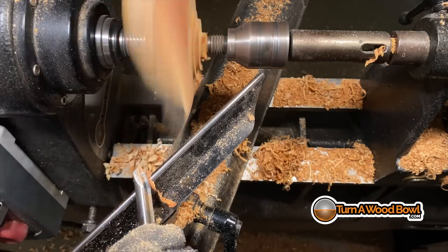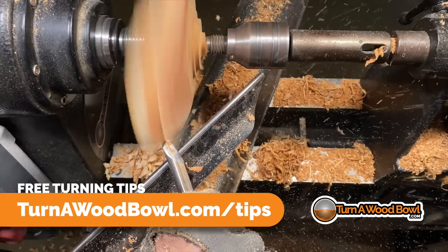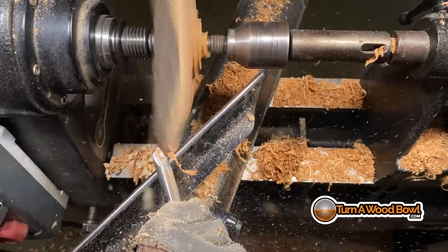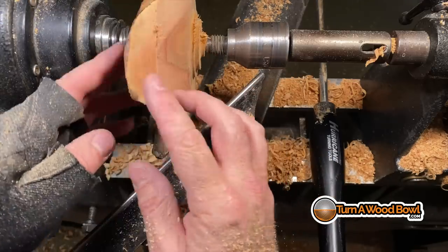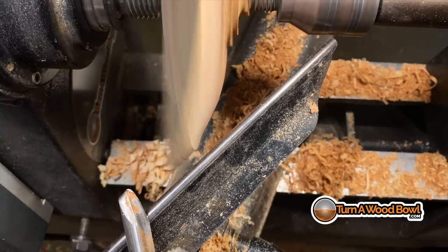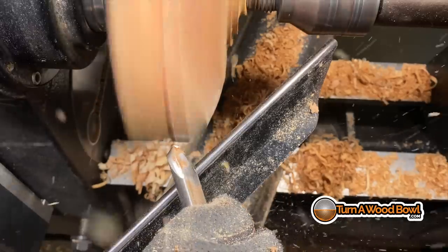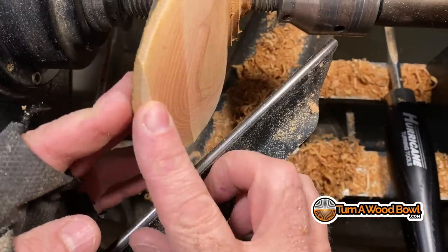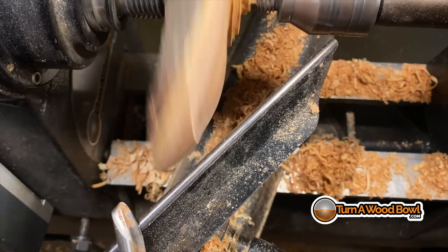I'm going back up to those wing tips to take off a little bit more. Because we're cutting air on the wings, you'll hear that clicking sound. I have to be very careful that I'm not pushing into the bowl because the bowl is going to give me no guidance whatsoever. What I'm doing is applying downward pressure on the tool rest and using the tool rest only as my guide — lining the tool rest up with the same angle of the cut I want to make, pressing down, and just shifting my body weight to make a very smooth pass along the tool rest. It just happens to be in the same path that there's wood coming by.